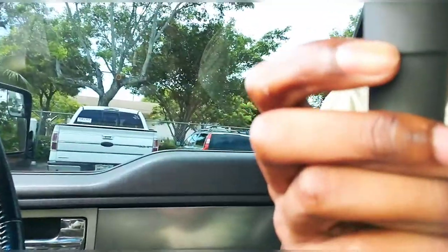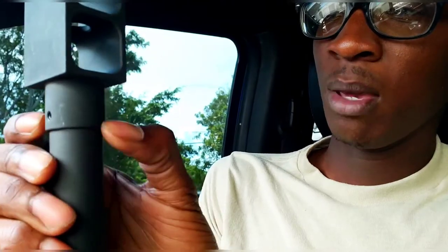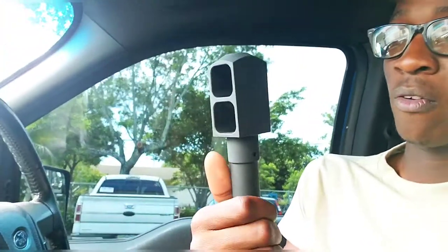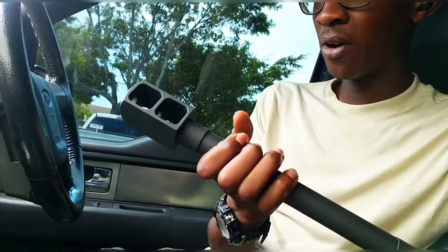We got the barrel back from the machine shop and the muzzle brake is installed. The thread pattern on the muzzle brake matched the barrel, but the barrel was a little too long. They took off less than half an inch from the barrel to make it fit perfectly. The barrel would screw on before, but you'd only get like three or four turns, so we had to machine it down just a tad. That's finished now — it's just a barrel, and we should have the final outcome later today.